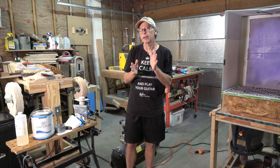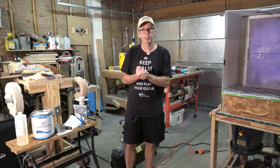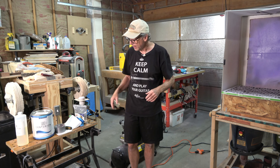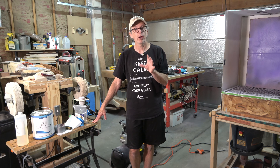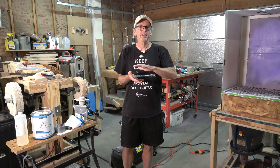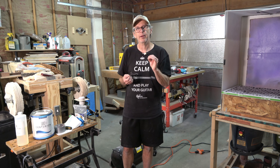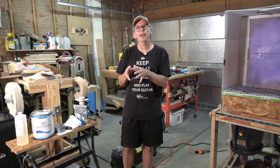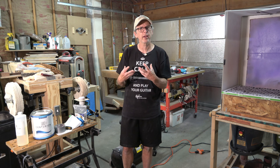Those are the reasons why I like to use it, and I've already had the opportunity to spray multiple guitars with the product. When I spray a guitar, I typically clear coat it with about 12 coats. This gives me the depth I want and builds up a film thickness sufficient to prevent sanding through to my underlying color — whether it's stain, dye, or paint — as I'm level sanding. It's sort of a good protective layer.